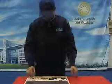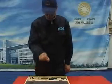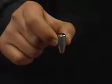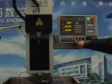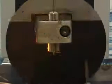Take out the guide apparatus diameter 1 mm. If you use cone-shaped guide apparatus, please put the small side down and lock it tightly with the 4 mm spanner. Fold down the Z-axis and thread the electrode through the guide apparatus, and stop when the electrode comes out around 3 to 4 mm.